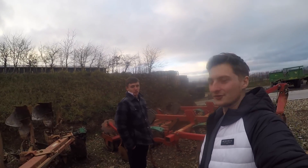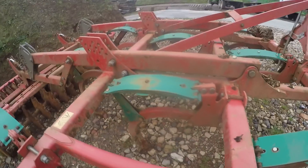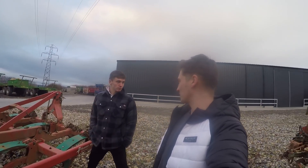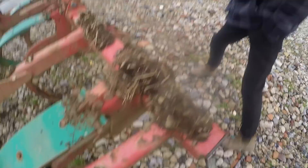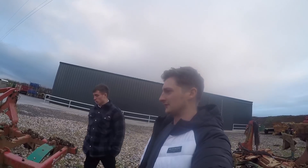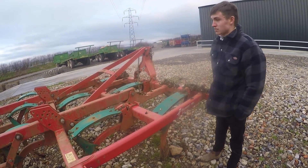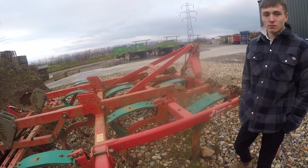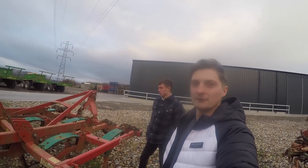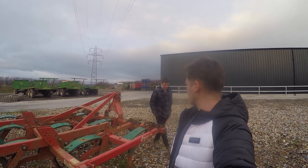We like using it for the spuds because it has the legs — and as we have a fair bit of stony ground around here we find it works pretty well. We're still snapping a shear bolt now and then, but they usually just crack on that bracket — normally the front three legs. At cow farm number two we do have three conventional chisel plows with shear bolts that we didn't show you because it got dark. Generally we get on really well with this and use it for ripping up the fields after harvest, leaving it in a nice position for the farmer.